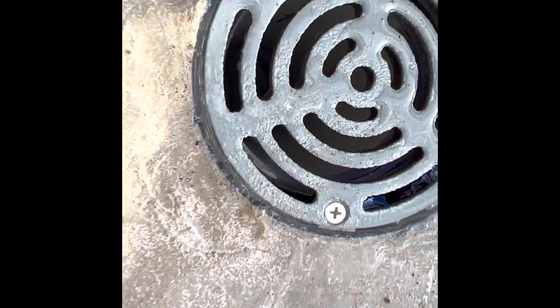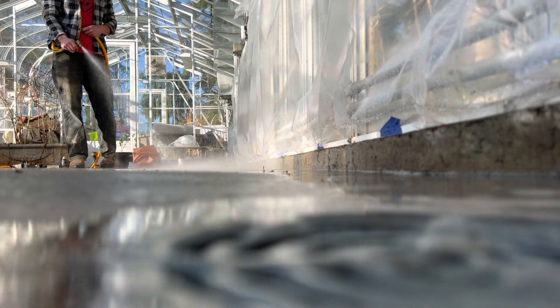Then we checked out our drains. We left it for the weekend, came back, took the tape off the drains, hosed everything down, and made sure the concrete got a little bit of water — which actually helps it cure up. We checked our slopes and made sure everything drained really well to the outside corners where the drains sit.